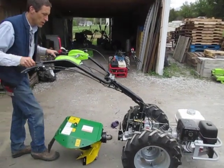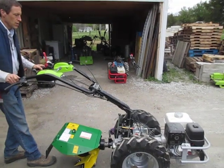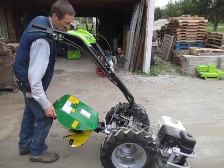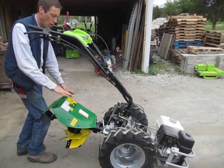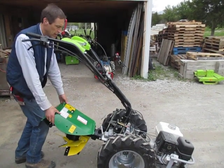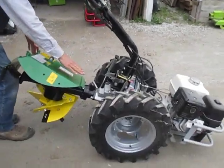I'm going to go ahead and mount them up. There is a little grease on the quick couplings, which is what you want. Go ahead and mount this thing up like this — it comes all the way back. I'm going to drop over the quick coupling pin and I'm going to rotate the plow because the plow needs to be a little off-center. The plow is not one of the implements that is centered when it's on the implement — it's actually rotated slightly. So it dropped all the way down as you can see.